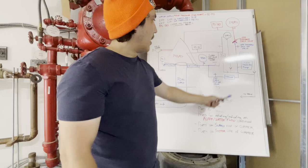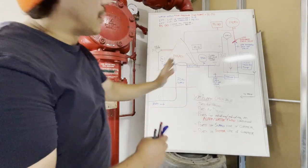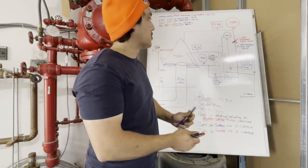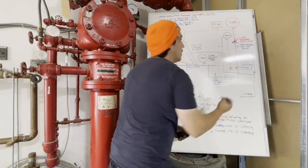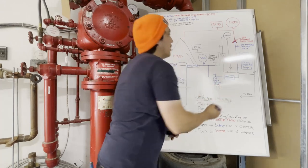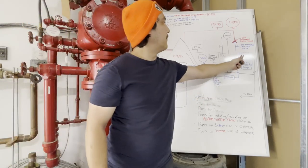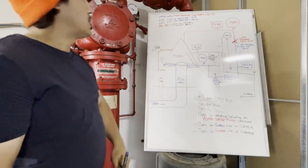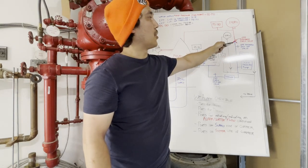There's the pump itself — the motor — and then there's actually a pump head, this big brass thing right here. That is directional; there is an arrow on it to show you the direction of flow. Water supply comes in, and direction of flow goes this direction. After my excess pressure pump on this system, they have a half-inch relief valve directly downstream of it, and then they installed a shutoff valve — the excess pressure pump discharge shutoff valve — followed by an excess pressure pump discharge check valve.